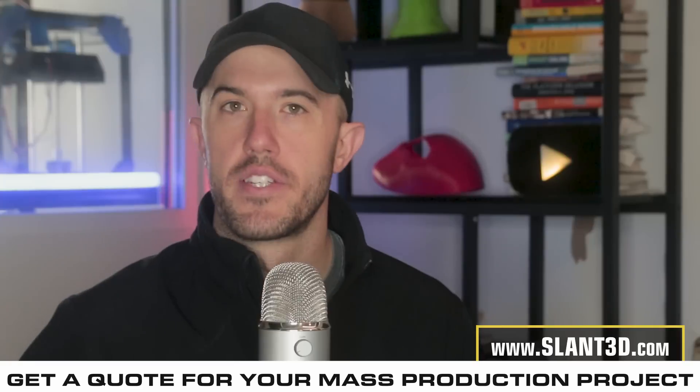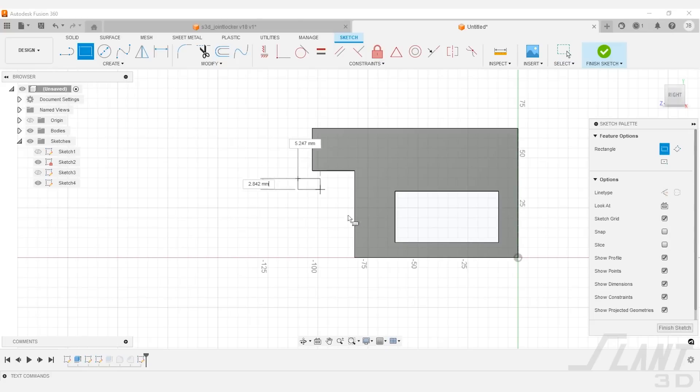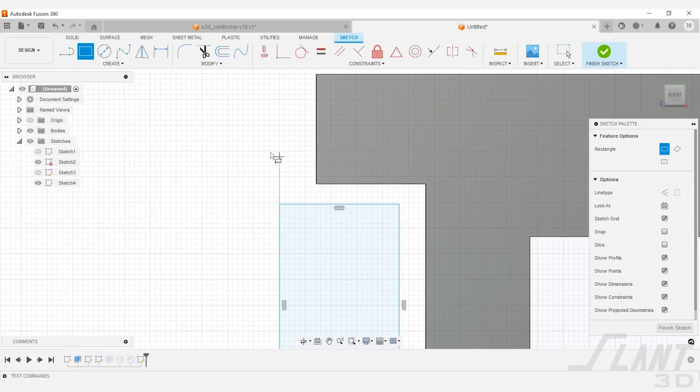Sometimes you have to have an area that is supported — the geometry will require it. But you don't always want to default to the manufacturer's slicer because there are differences in settings and variations in how things actually work. If you can control supports inside of CAD, within the parameters of a standard machine with a 0.4 nozzle and a certain flow rate, it's much easier to design supports directly in CAD. That way they go right where they need to be — absolutely minimal and very easy to control and tweak, rather than trying to find the magic recipe your printer was using when making prototypes.